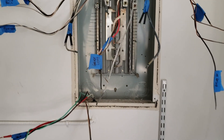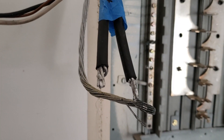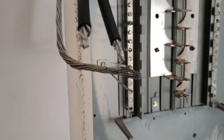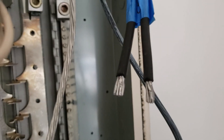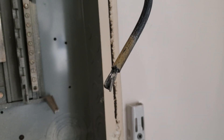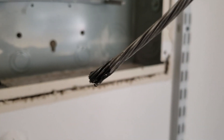A little bit of an update. Those are AC wires you're looking at right now — they're not being cut properly. I think somebody was replacing the breaker previously, messed it up, and they didn't put any anti-oxidation compound, which is kind of required on aluminum wires. As you can see on the ground wire, they do have anti-oxidation compound. Same thing on the wires for the stove, which I will not be using anymore. Anti-oxidation compound was not applied. However, there is one on the neutral wire that goes to the stove, but that one looks like it was getting a little too hot in that corner.